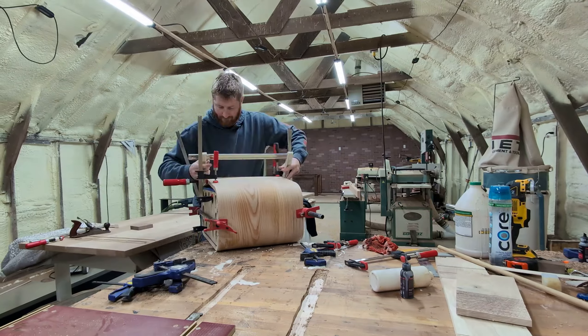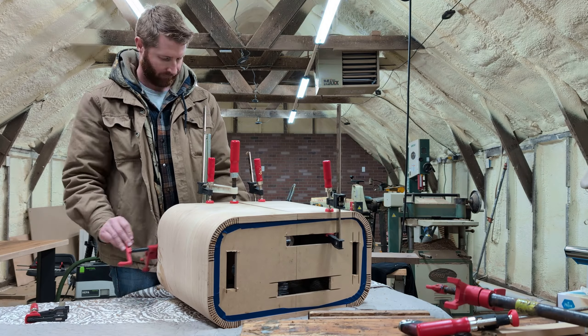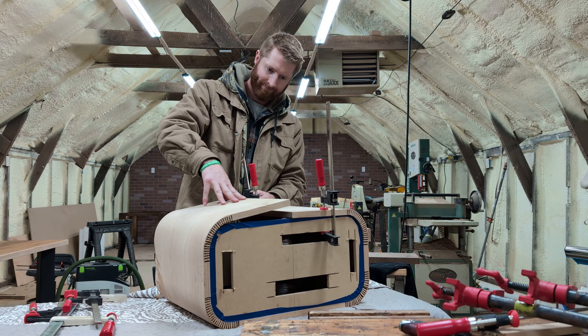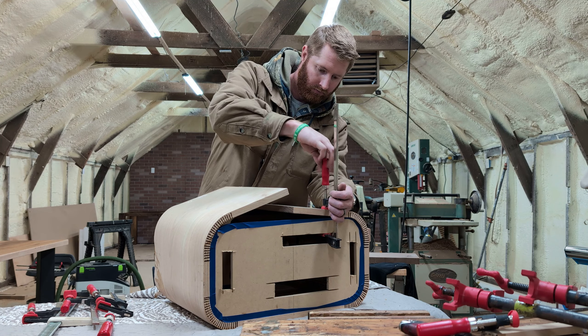The water did help — letting it sit clamped up in the forms it did somewhat hold that shape, so I went ahead and added all the glue and clamped it together and let it sit overnight. The next afternoon I was excited to get back to the shop and get all the clamps off and see what kind of masterpiece I had created — when boom, the first of many failures in this project. After several f-bombs I sat and looked at this and wondered what I did wrong. What I believe happened is these joints when I curved them around, the wood was not actually pressed tight against each other — there were still large gaps in those curve cuts, and wood glue needs to be clamped tightly to itself in order to adhere properly. I figured if I could somehow hold that seam from opening after I released the clamps it might still work out, so I CA glued some culls across the top of that seam in hopes that would lock it into place.